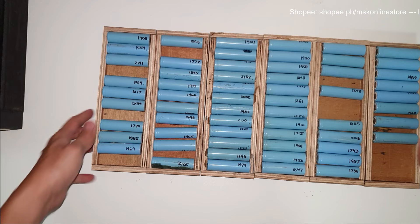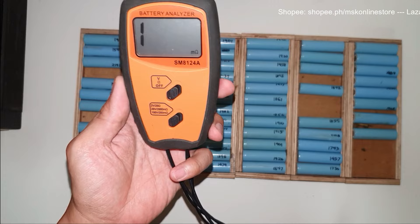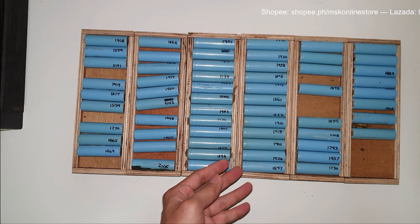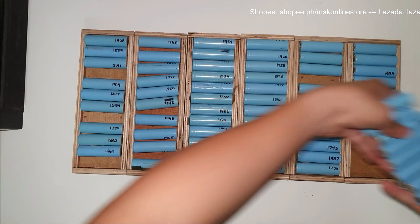That's the resistance check. Once again, the tester we used is the battery analyzer SM8124A. So we are left with these cells. We have the low voltage ones at 4.01 and 4.02 volts, and separately, the ones with high internal resistance.